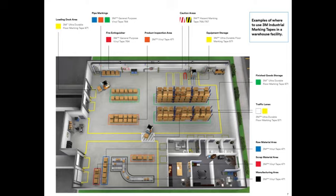Red is safety, of course, defects, scrap, red tag areas, and possibly some others. Wherever you don't want your workers to be, or there's a concern, it's typically demarked by a red marker, and this is a great opportunity for that too. Green usually is for finished goods, the area that's already wrapped and ready to hit the back of the truck and get out of the building, that type of thing. Blues are raw materials, pre-manufacturing storage areas, that type of thing.